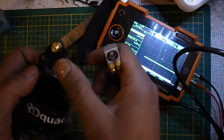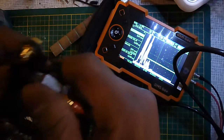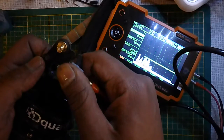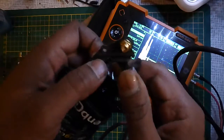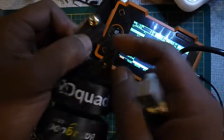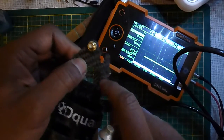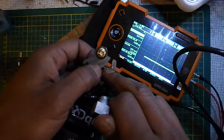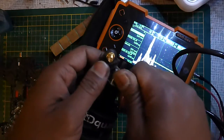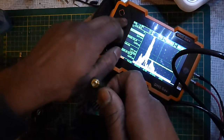If you're, by the way, interested in knowing more about NDT, what the fuck is this? This doesn't look too good. Maybe I'm pushing too hard. This seems to go beneath 1 millimeter, you see. On the eye, there's nothing wrong here. You can see it's a CNC'd part, so maybe during CNC they put in too much heat or did it too rough, or I don't know, but clearly you can see this is my normal echo.